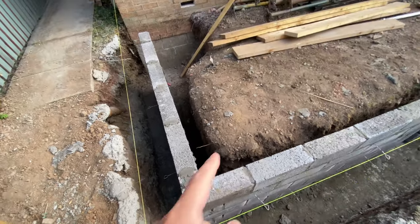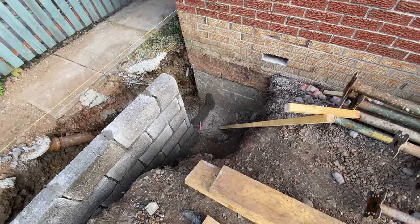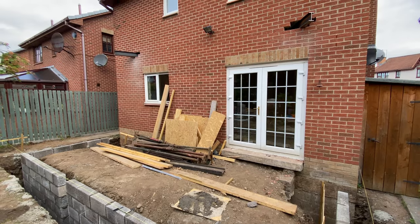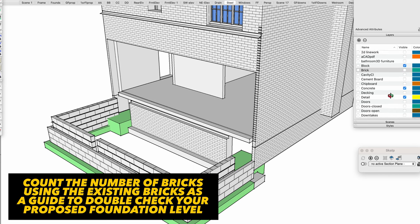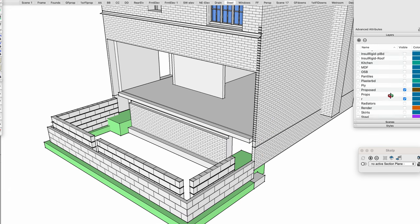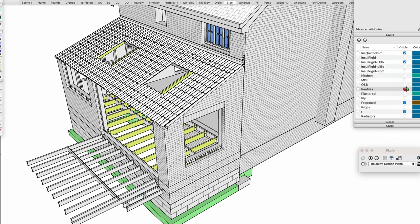Then onto the trench blocks, building the masonry up to a point where the floor joists will rest on it, since we're building a timber floor for this extension. Just make sure to get those block courses dead level and square to the existing building, as this sets out our building and our horizontal courses for the facing brick. For laying brickwork of this size and nature, where experience is everything — especially for facing brick — this is one of the few trades I'll subcontract out. After laying a load of brick courses it's a complete disaster to find out your setting out is wrong or your horizontal courses are not level with the existing house. You also need to be thinking about your mortar mix and keeping it from hardening — not very easy.